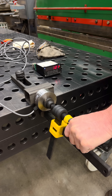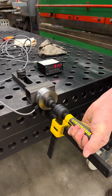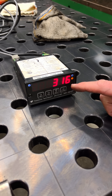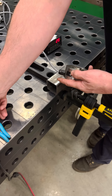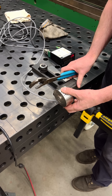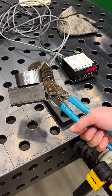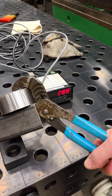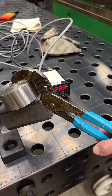Of course it's moving at 320 pounds. You can see how easy it is to push backwards — I'm not even truly trying, just a finger and my thumb to push it backwards. 320 pounds is not a lot of force. This is just a pair of normal vice grips; I can do this with relative ease just by squeezing my hands. Everybody can get up to 300 pounds, so that is not a lot of clamping force before this one bolt starts to slide backwards.